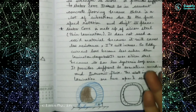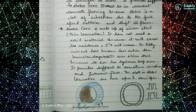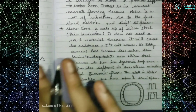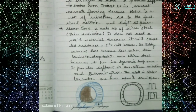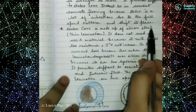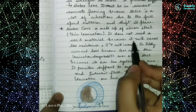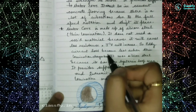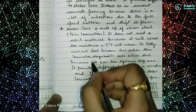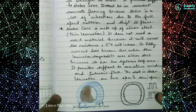They do not use a solid piece of material because if solid material is used, it will have less resistance and therefore I²R will increase — meaning eddy current will increase, causing a lot of eddy current loss. To reduce eddy current loss, thin lamination layers of silicon steel are used instead of solid material. Silicon steel is chosen because it has a small hysteresis loop area, reducing hysteresis losses.